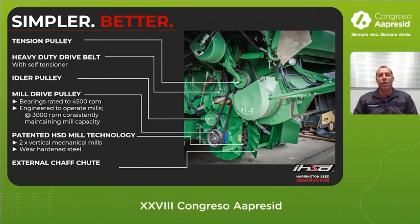As you can see on the side there, we run off the slow speed chopper drive on a John Deere machine. It's idler pulleys and pulley drive pulleys driven direct off the engine in conjunction with the chopper. The bearings are over-specified for the job that they're doing. They can spin up to 4,000 RPM and run 300 horsepower through them.